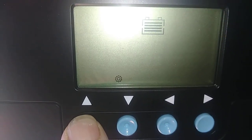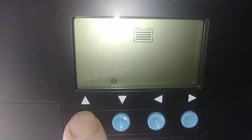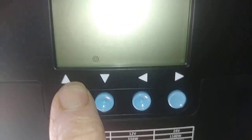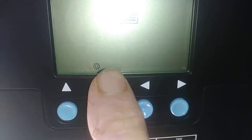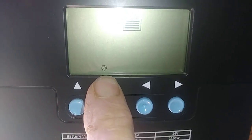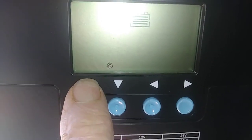It's going to take you over here to change the parameter for your battery. This is going to go through a few phases: 12 volt, 24 volt, 12 and 24, 12 volt. Since my system is a 12 volt, I'm going to leave that at 12 volt. Also, just a quick note — that icon right there is telling you that you're in the programming mode.